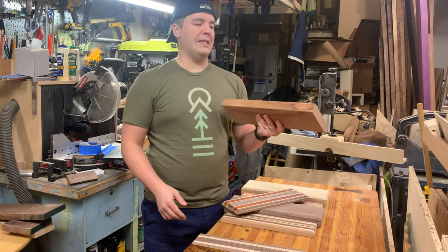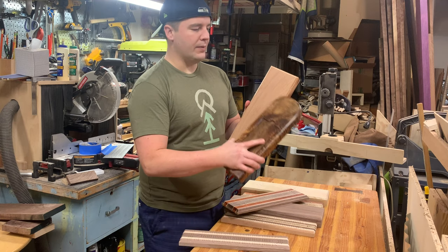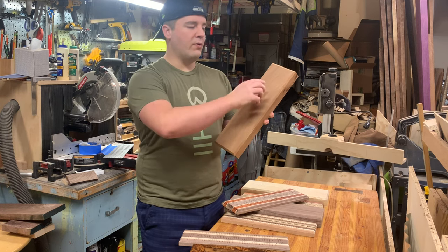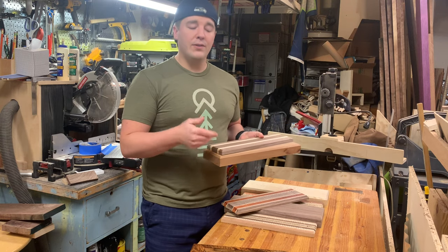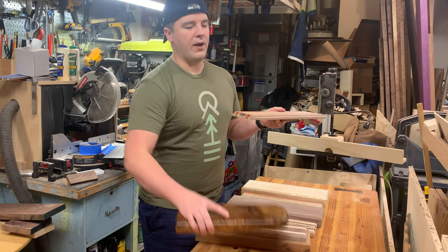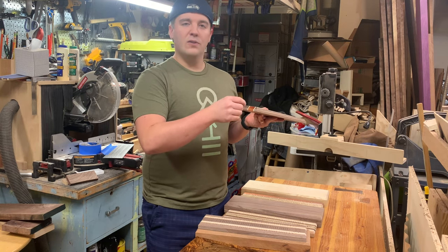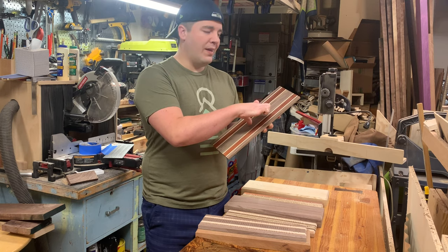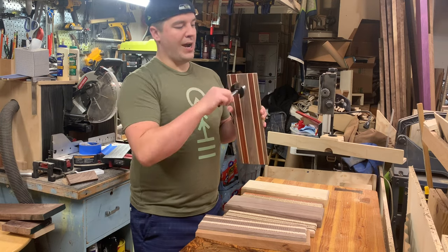What we're going to do is take a thicker slab — about six-quarter, about an inch and a half — and the board's going to go on top. I'm going to drill out a spot for the pegs, drill out a spot for the cards with some router work, and then it's going to swivel using magnets — all self-contained but with a really nice elegant, refined look. There are certainly other options for peg storage. If you want just a single board, you really need to make it thicker. A lot of people will drill a hole in the end and throw a cork in, or have a little trap door. I've also routed out a channel in the middle with magnets and a metal plate.